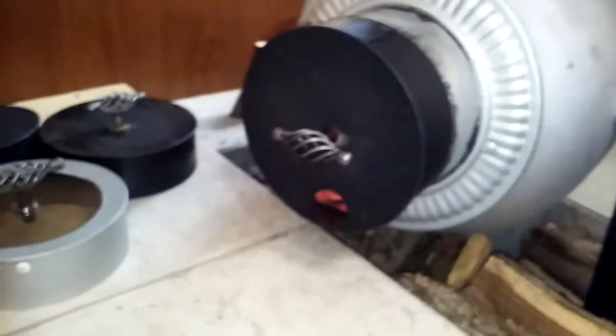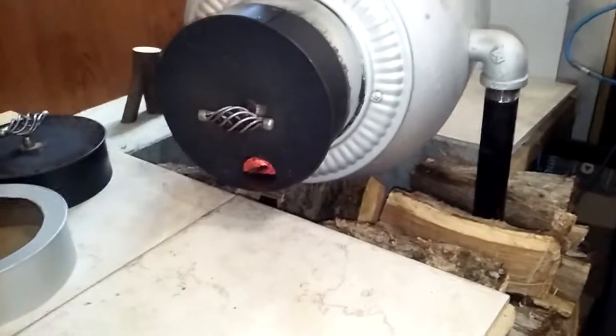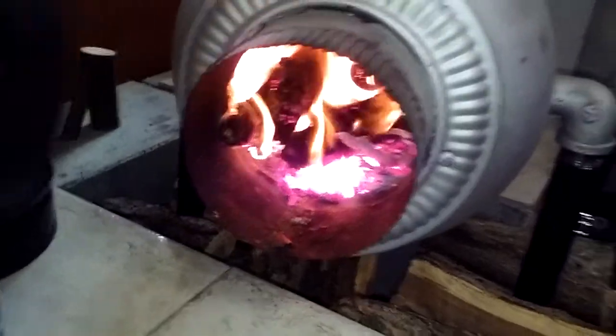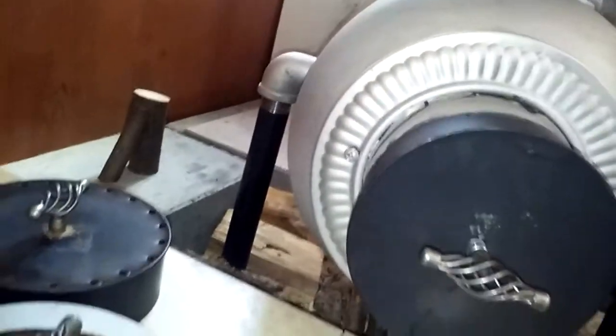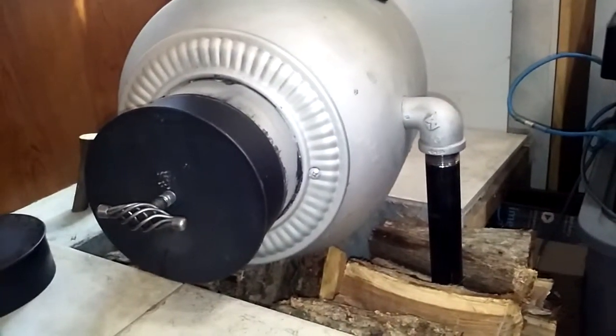This wood stove is pretty much like a vacuum cleaner, sucking air through, and that air has to be replaced somewhere. It pulls in cold air from all the little nooks and crannies, even more than normal, and can make some cold, drafty spots. If I switch to this solid door — no holes — then no air goes in through the front. Everything goes through those two stove pipes from the outside, so the warmed air inside is not used for feeding the fire.